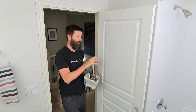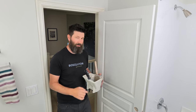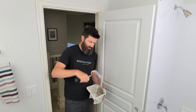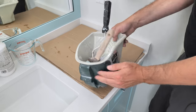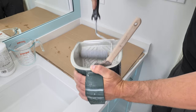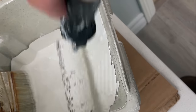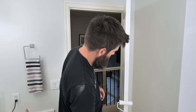Tip three is how to actually get the paint on the door — the name of the game is speed and accuracy. For this three-panel textured door, I use a combination of a mini roller with a 10-nap synthetic roller that holds a lot of paint, and a regular two-and-a-half-inch angled brush. Get a minimal amount of paint on the roller and hit your edges first — too much paint will fold over the sides and make a mess.